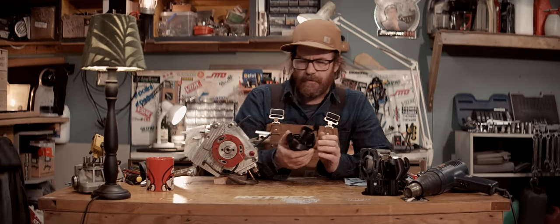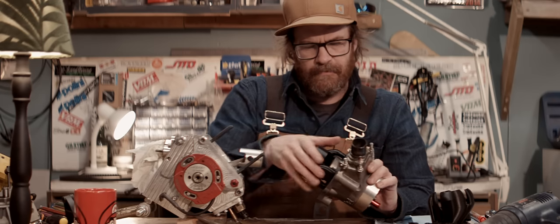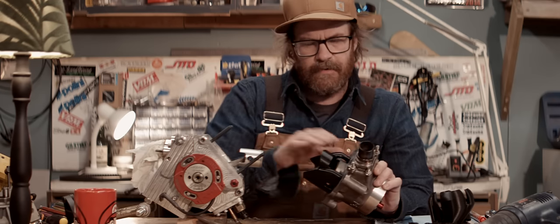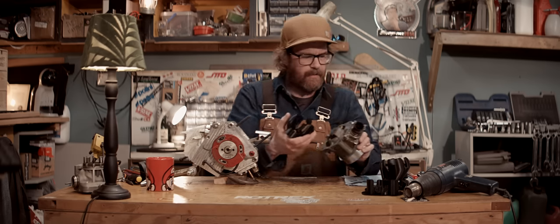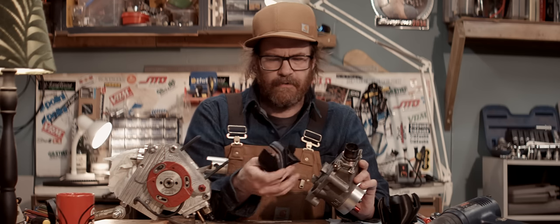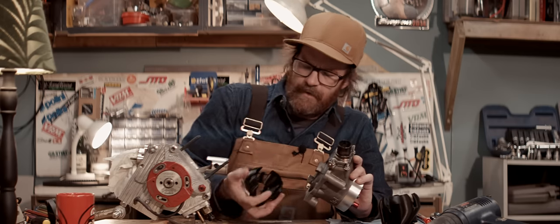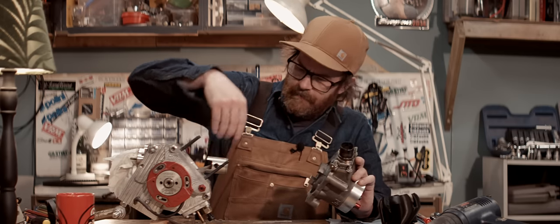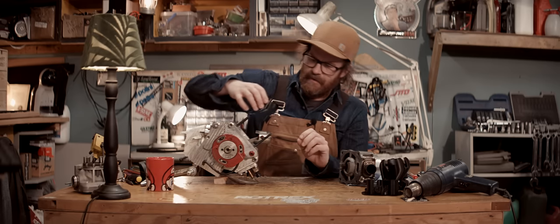This will bring primary compression up to about 1.3:1, which should be better for reeds. It's a really tight fit. We'll need some sanding to make it fit better. Might even need some heating to have it conform. It should be the right shape. Quite a challenge to model something with okay inside shape that will still fit the cylinder and be able to drop down in here. Don't know if it will be able to drop down there yet, but it should be.